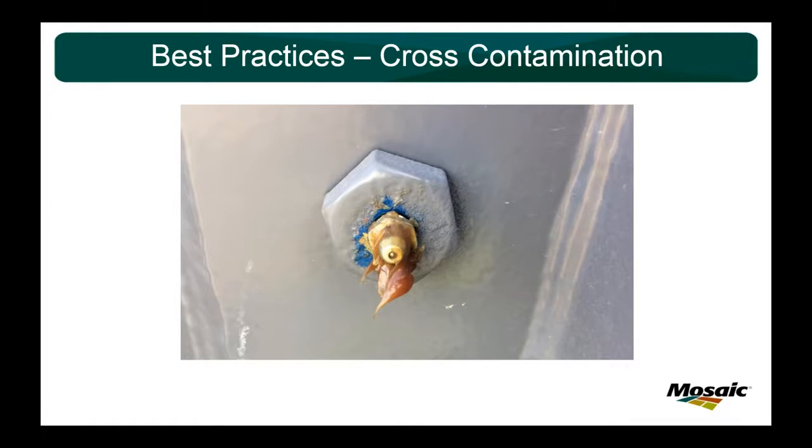And a lot of people say, I don't really need a color code cap because I just leave a dollop of grease on the fitting. And to that, I would just reference this picture where every 3 months you're going to come around and grease something. Usually that's our frequency for greasing motors. What kind of grease is that? Is it providing any contamination protection? It's definitely not, because your ball check is exposed.